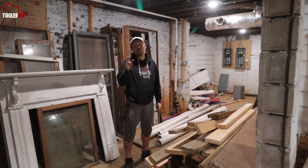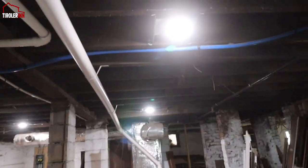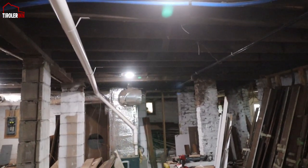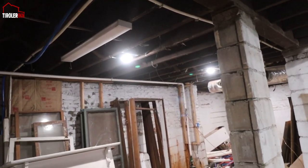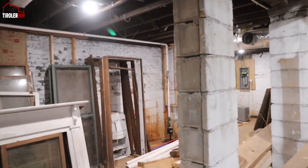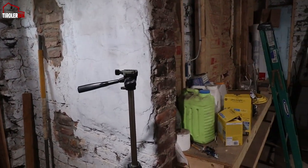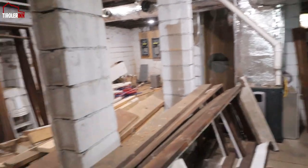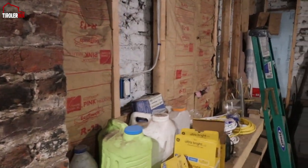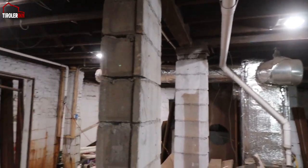We didn't have lights there, so we upgraded that too, since I had some leftover boxes. So the two lights that we have here in the hallway, I just connected them to the same circuit as we have over here. It was just easier because I really don't have any way to attach a box anywhere here, because it's obviously only brick. There are no 2x4s or any walls up, so to keep it easy, I just attached them to the same light switch, and we basically control this whole front section here with one light switch for right now.